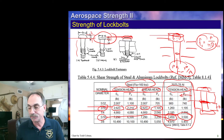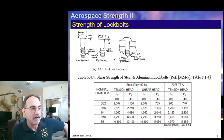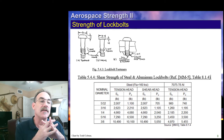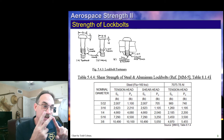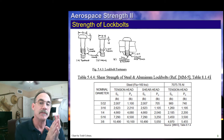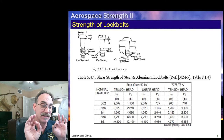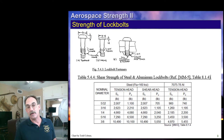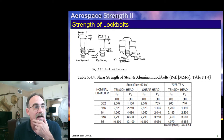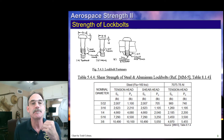That's how we analyze lock bolts. As with other fasteners — though this is not a threaded fastener — if we have shear alone, tension alone, or bending alone, we can write margins of safety directly on that single force or stress. However, if we have a combination of shear and tension on the bolt, we need to compute the appropriate stress ratios and then use an interaction equation. Steel lock bolts and aluminum lock bolts have different interaction equations.